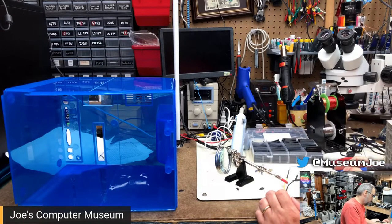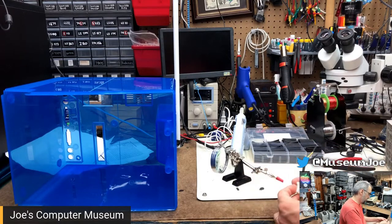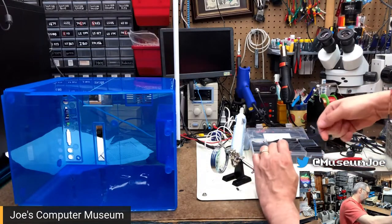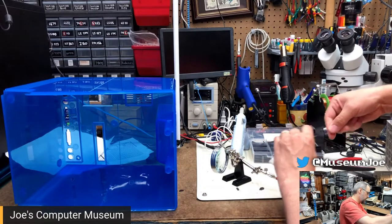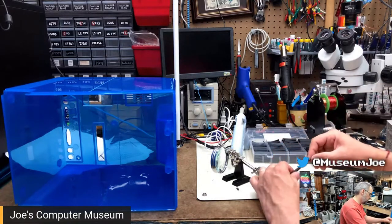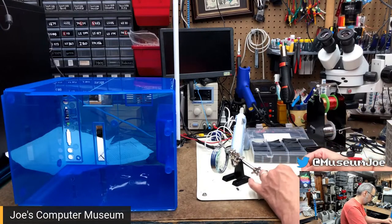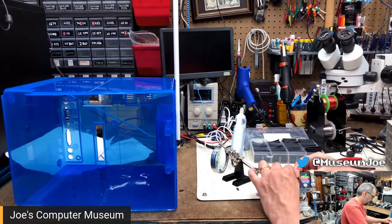So that is done. So we heat shrink this bit. And again, the heat shrink helps make the mechanical connection a little bit better, but it also just protects the wires from shorting out. It's heat shrinked. Now we run the big chunk of heat shrink across both joints to create them as one joint. I'm going to twist these wires together a little bit just so they're a little more tidy. Heat shrink the entire joint together with heat shrink that is slightly too small for the job. There we go.